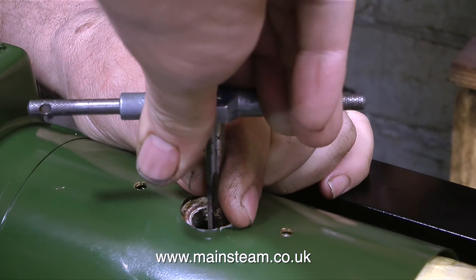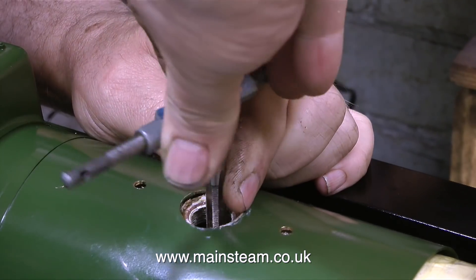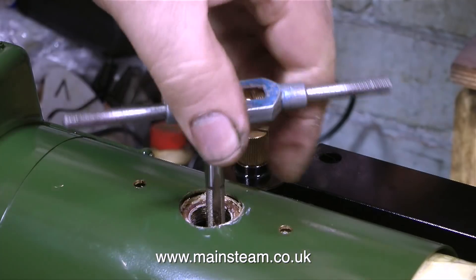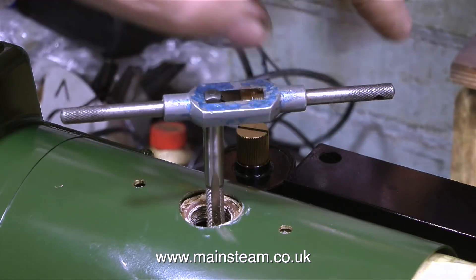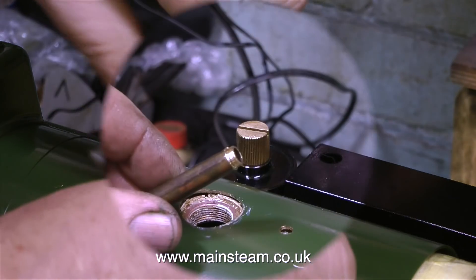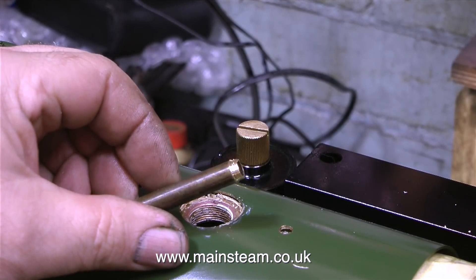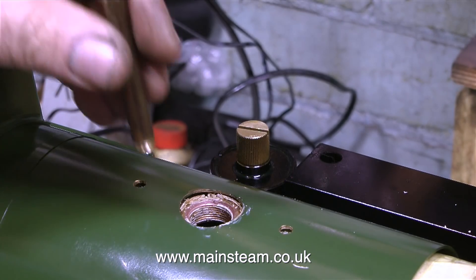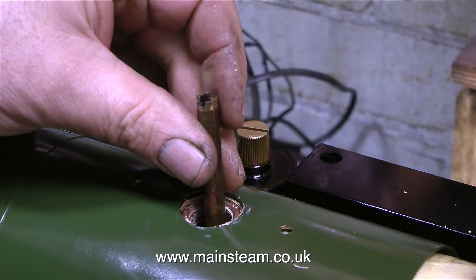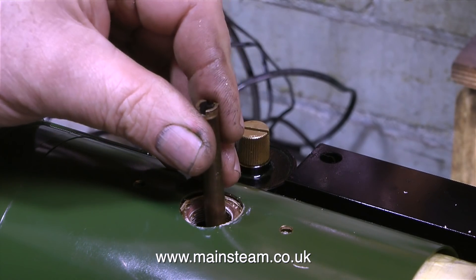This is not much of a job, but it should have been done properly in the factory in China. Instead it's been done in my home workshop in darkest Dewsbury in West Yorkshire, United Kingdom. But at least it will work when I'm finished with it. I'm currently re-threading the cross tube, which is the main tube that holds the regulator and feeds the cylinders, re-threading it 5/16ths of an inch by 40 threads per inch using my tailstock die holder in the lathe.